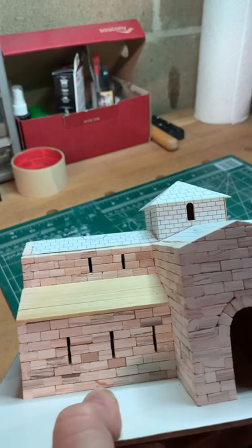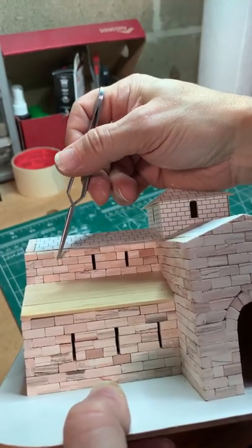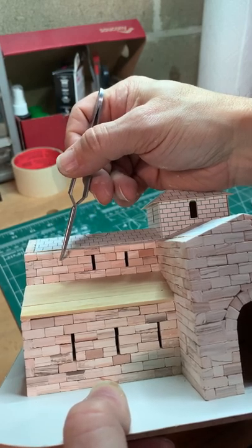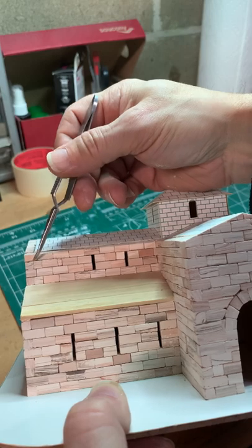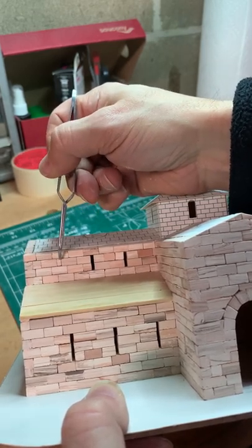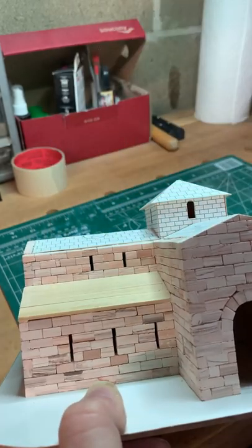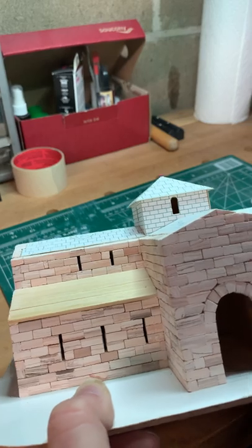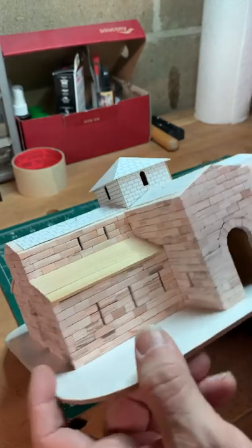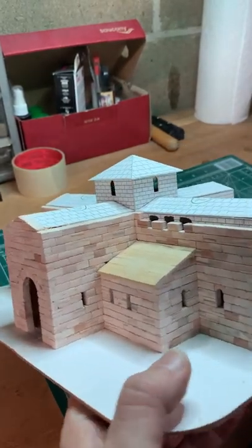We've got another one right here where you don't want the seams to line up. And so sometimes when you're putting the bricks in place, you find that things just don't line up right, like this one and this one and this one and this one. And you have to kind of plug in little pieces there to make it work. So that is some of the tips and tricks so far.